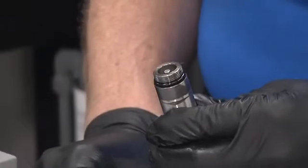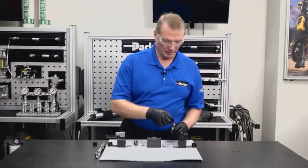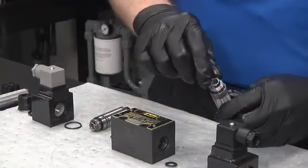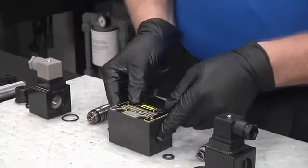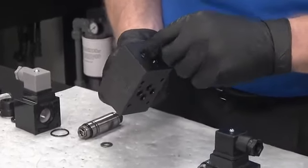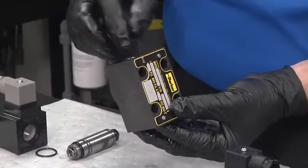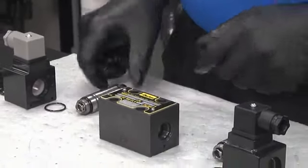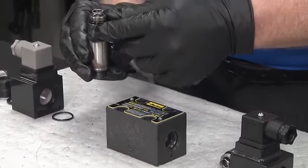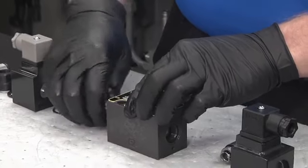Put the push rod back into the tube assembly along with the spring — do that on both sides. Then, holding the spool in place with one hand, take your spool washer and get it onto the spool, flip and do the other side. Set it back down, making sure everything is nestled correctly in the tube assembly, and go ahead and install the tube assembly back into the body.